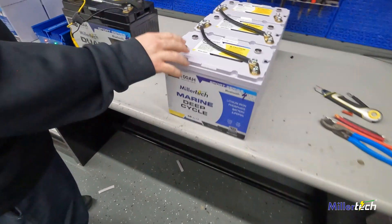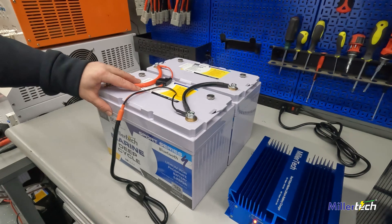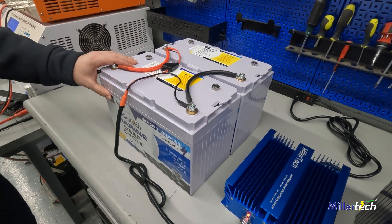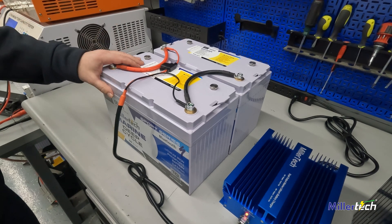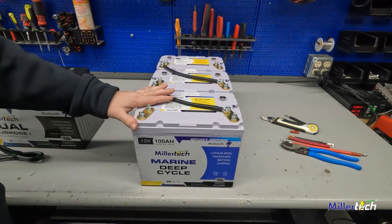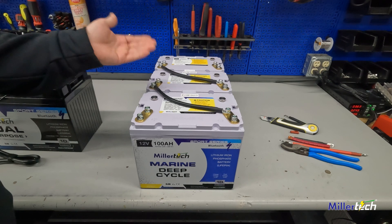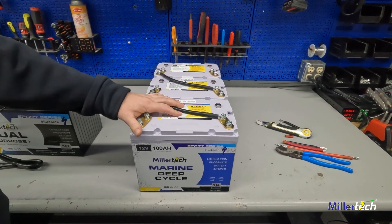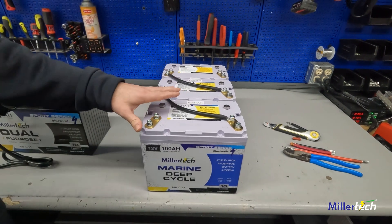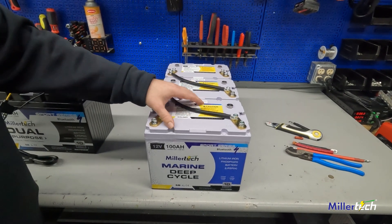So what are some advantages of using three 12-volt batteries to make 36 volts versus using two 36-volt batteries that are already built internally to be 36-volt? Our opinion, based on what we've found over the years, is that two 36-volt batteries — even a single 36-volt battery — is going to be much more reliable long-term than three 12-volts. The only advantage with three 12-volts is that if your cranking battery were to die, you could technically jump your big motor off one of these batteries. Also, if one battery dies, most trolling motors can run on 24 volts, so you can still use two batteries. The flip side is these internals are not typically made for 36-volt — it can work, but long-term you're going to have problems.